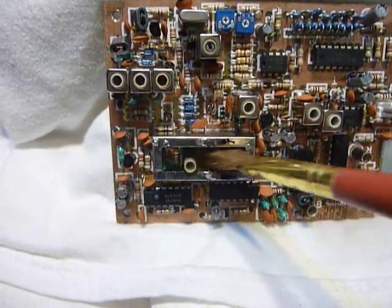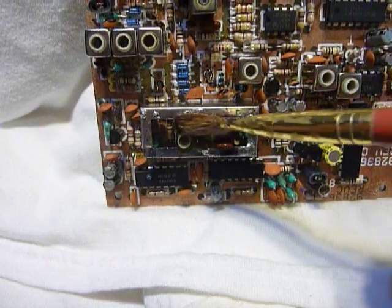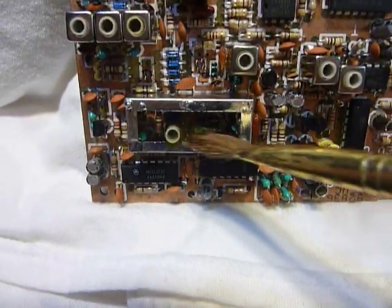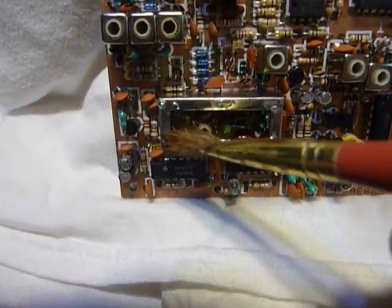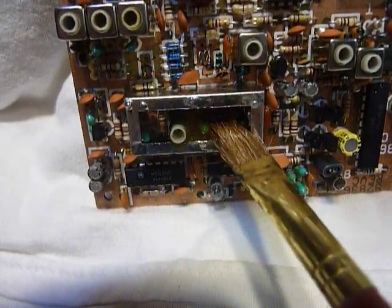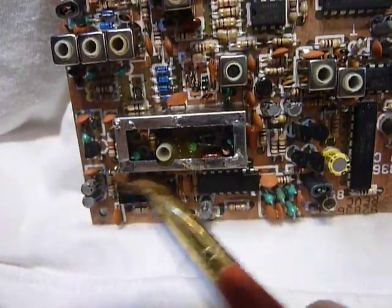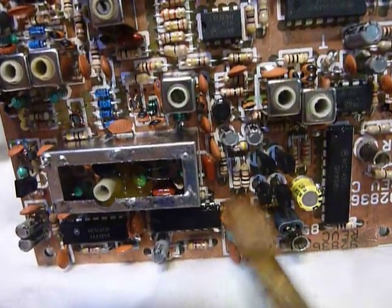I was saying I was going to heat this board. I think what I'll do is get an old lightbulb or a heat pad — just lay a t-shirt on top of a heat pad, turn it on, and leave it for a couple hours. We're interested in drying out the moisture, not cooking the parts. I am concerned about that because I've never done that to a board out of a TenTec, and some components may be especially heat sensitive.